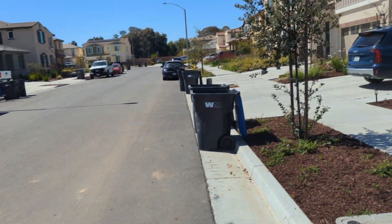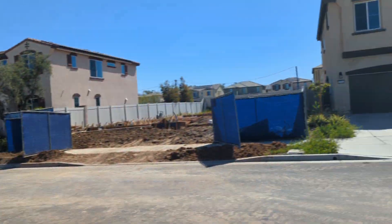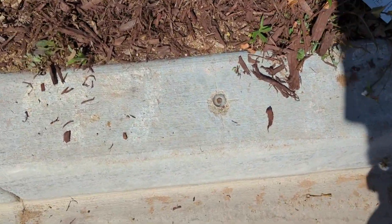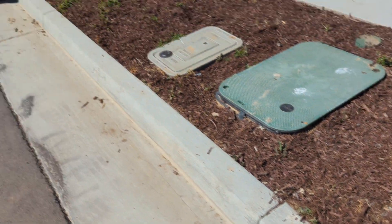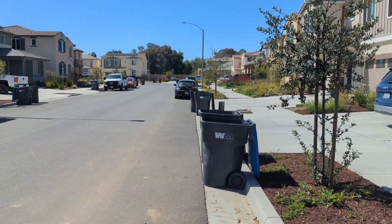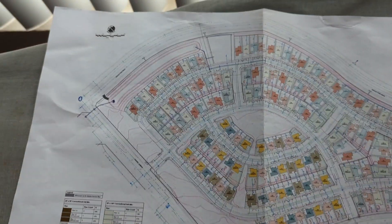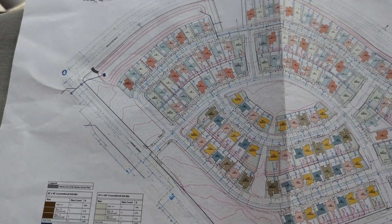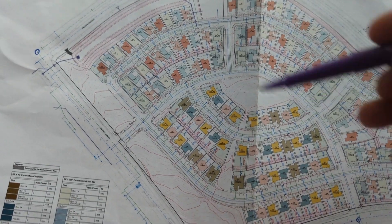Here's another job that is pretty much completed. We're doing these build-out lots form certs and we use our PL prods as control as well. We've scribed out where they are, set the nail and tag, and every single one of these has been located horizontally, and the vertical is trigged in. All right, back to control - the Palm Desert/Coachella area from the beginning of the video.